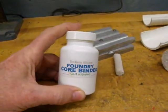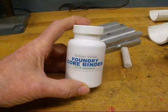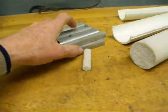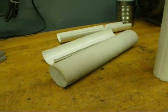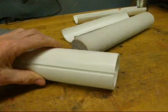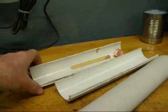It's a clear viscous liquid looking something like Karo white syrup, only it's not all that sticky. The core box I'm going to make — I'm going to make this big core, two inches in diameter about 10 inches long. We're just using common two-inch PVC. It can be used only once. I'll ram the sand in there, gas it, and then I will split it in two and throw away the old shell.